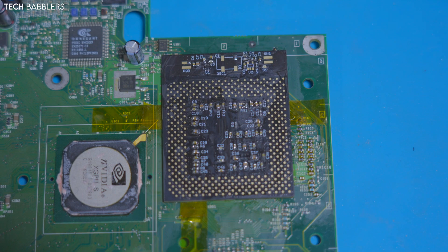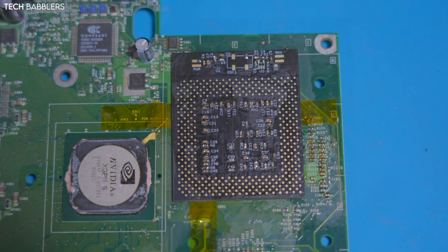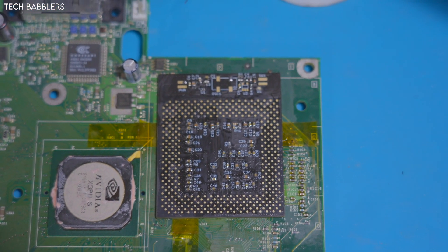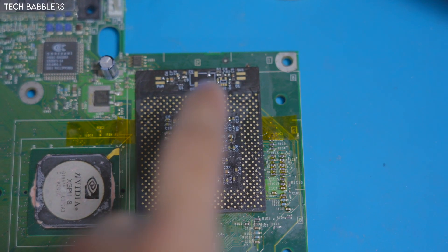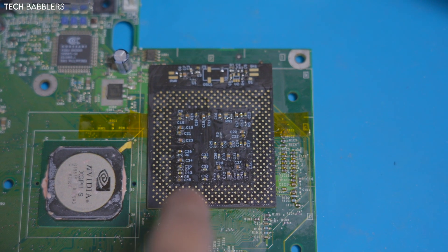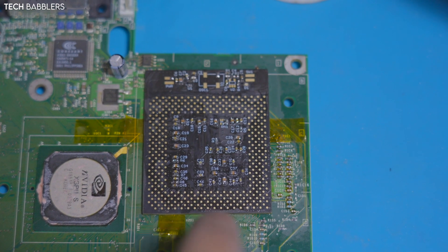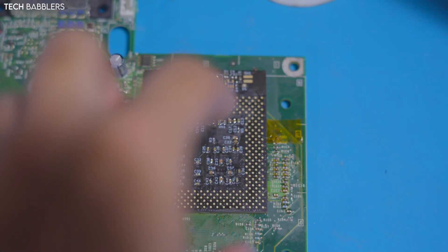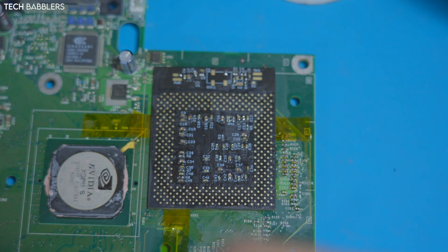Basically I'm on this step, and I'm not installing a 1.4 — I have a 1.2 chip. You might be thinking why the hell do I have a 1.2? I bought it a while ago and I'm not sure if this is going to work, so I thought that would be the cheapest choice to go. I'm going to have to order the parts I'm missing. Once I get those, I'll come back, put on some solder paste — it goes on each one of these little pads — the chip goes on top, goes back on the reflow machine, and hopefully it works.